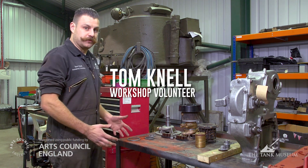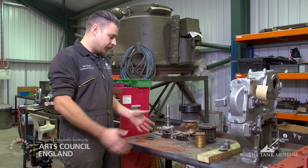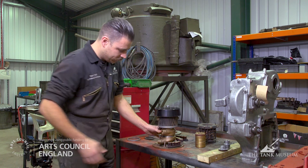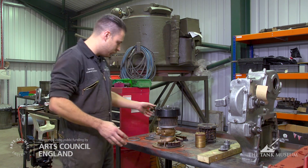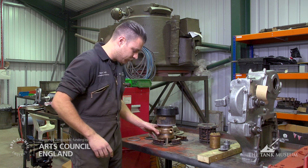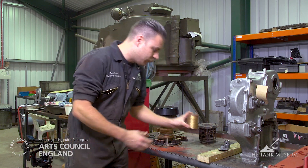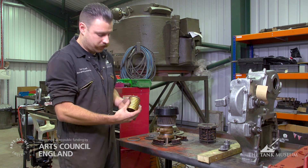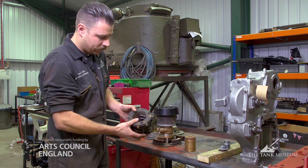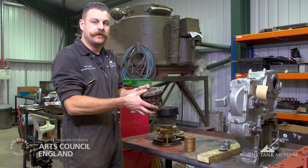As part of the reinstallation of the electrical system, we are continuing to look at the rotary base junction, or RBJ. When Jonathan was over in Australia, he obtained a rotary base junction from Batrac. This is an earlier Mark 1 — as you can see, it's made of phosphor bronze. As those materials became rarer, we have one from our Matilda which is made of aluminium alloy. You've got the oil galleries responsible for the power traverse, and the top section is for the electrics. Inside, you've got a tower made of tufnel and brass. Each of these rings is a contact with which this part rotates around, with carbon brushes running on these brass fittings, responsible for an individual circuit within the turret.